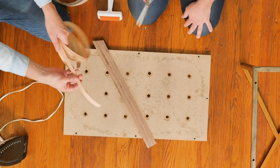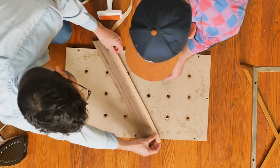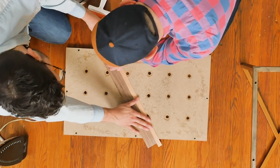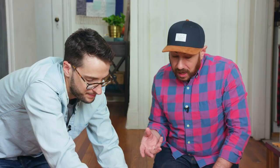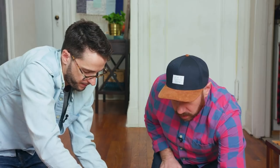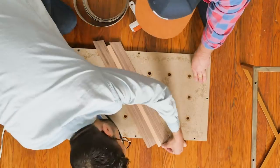Very nice. We got two different color veneers, and this one is much thinner — this is a birch — just to give it a little bit of interest. We're just going to work one piece at a time and line it up. The greatest thing about these wood veneer strips is that they are movable. If you work with them quickly enough, you can peel it off if it's not close enough to the other veneer — you can move it, you can shift it. It has a little bit of wiggle time. We are just going right over the holes and not worrying too much about it.